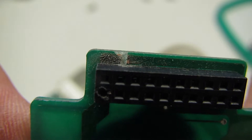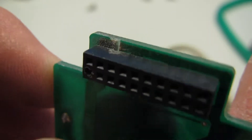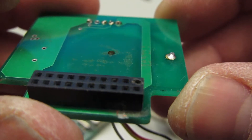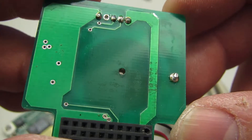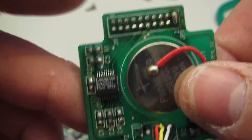That's an interesting way of fixing the trace. Looks like they got in there with a Dremel tool and ground the trace away to isolate the two grounds. Interesting.